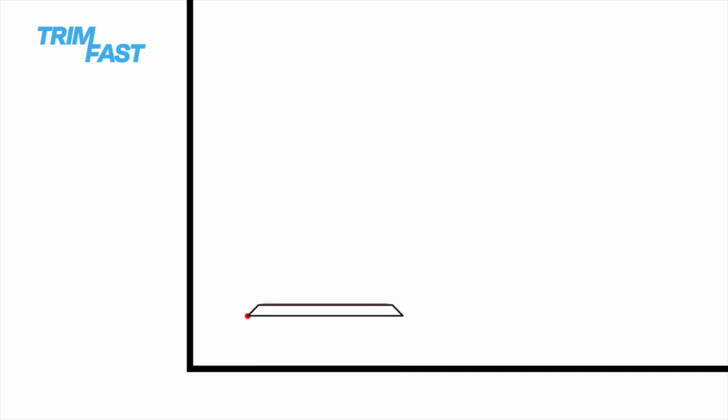We will now need one of the side pieces of molding. For our example, this would be one of the 18-inch pre-mitered panel moldings. Align the molding with the trim that is on the wall to create a 45-degree angle. Use the level to make sure the molding is flush and draw a light line with your pencil along the inner edge of the trim. Remove the backing from the trim and, like we did previously, lightly adhere it to the wall, using the pencil line as a guide. Confirm that the molding is level, and if it is, adhere it to the wall.